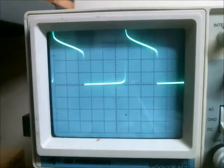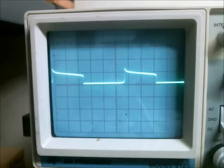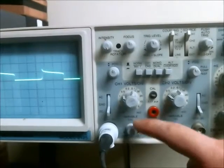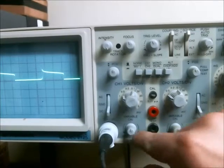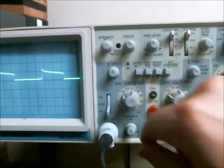That's where the voltage should be, but eventually it just falls back down to its initial state. So maybe the potentiometer associated with this variable calibration knob is damaged or worn out, or the sweeper's loose. I'm going to have to open up the oscilloscope and take a look.